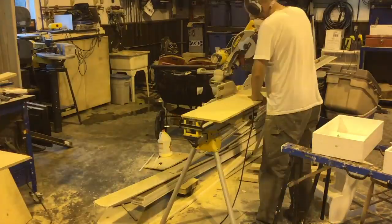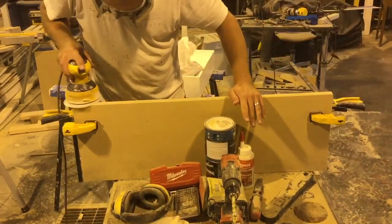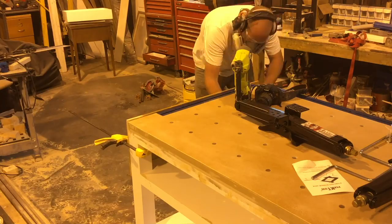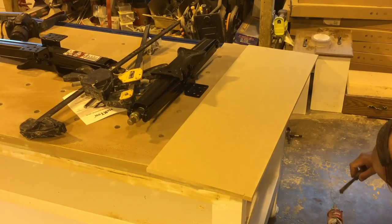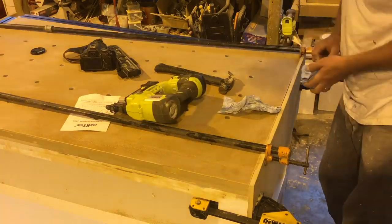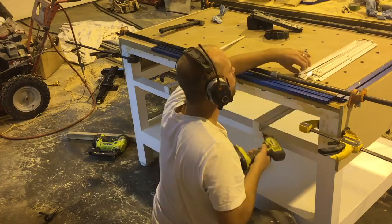I then proceeded with making fascia pieces for the top portion of the frame. Before attaching each piece to the table, I gave the top edge a light sand and put a quick coat of varnish on the edge so that if water was ever spilled it couldn't soak and swell the MDF. I used construction adhesive along the perimeter, brad nails to secure the pieces, and clamps to tighten everything to the edges — I did this for all faces to give a box look to the entire tabletop.